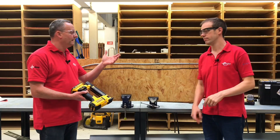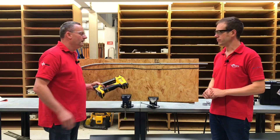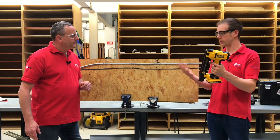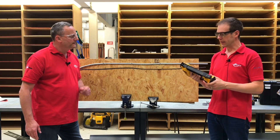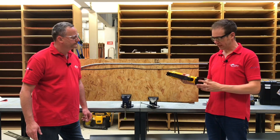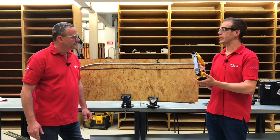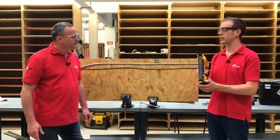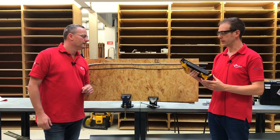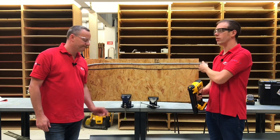We can clearly see it clips very quickly, which saves electricians time, though it might come down to personal preference whether they go the stapling route. It's a really nice, well-made bit of kit as you'd expect from Dewalt — there's a window showing when you're getting low on staples, it's very easy to load and reload, and the battery system is super flexible. But it is down to the individual electrician to decide whether they go with the more secure traditional clipping method or whether they're happy with more speed and consider this to be supported rather than secured.